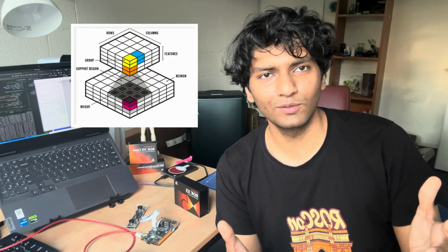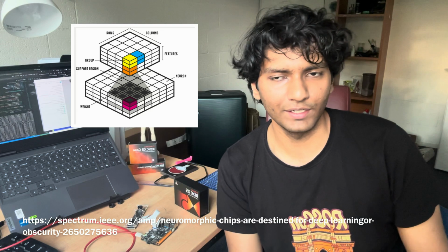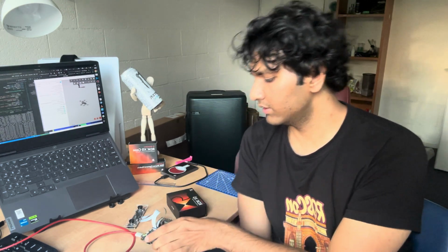And I'm not talking about a big GPU, because it doesn't make sense to put a big GPU on a drone. But what you can think about is a neural processing unit or brain processing unit. So I have this one chip that is by D-Robotics. It's called RDK X5. It's like a Raspberry Pi, runs on Linux, but it also has a neural or brain processing unit on it. So what this does is it runs AI on basically a hardware accelerator for AI, and that's quicker, and it's all on this chip.